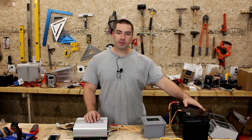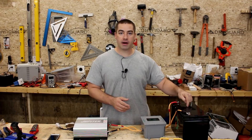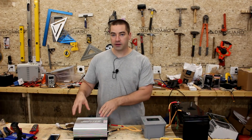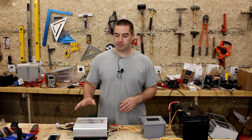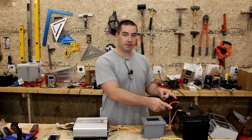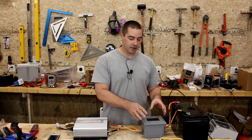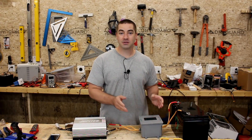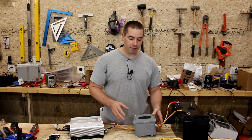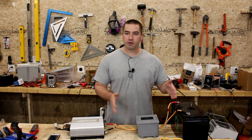It's time to test the new meter. I've got it hooked up to my 12 volt battery — I built this battery in a previous video and I'll leave a link in the description below. The wires run through the meter and then to this inverter, which is a cheap inverter I picked up for its capacity. It was really easy — I just had the positive and negative of the battery and the positive and negative of the inverter, and I did not have to mess with any of the wires associated with the meter. I did notice that the wires leading to the battery are a little bit shorter and those leading to the inverter are a little bit longer than I'd like.